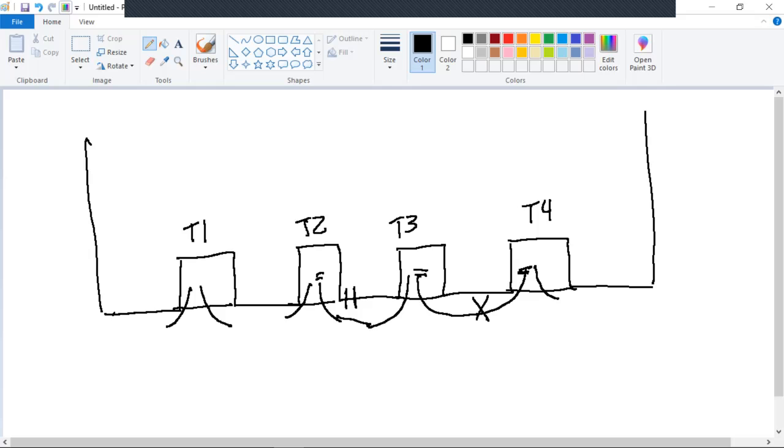All right. Now I'm getting ready to restore. What do I need to do? T2B closed, which does what? Restores power to T3A, T3, right? And then I'm ready to go to T4 and do what? Close in your fuse. Close fuse. Does it work? No. Look here, guys. It's supposed to be in A. You're feeding B backwards. Now, will it work? Yeah. It will work as far as restoration is concerned.